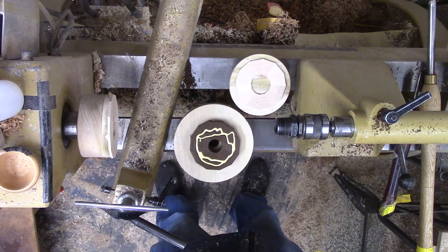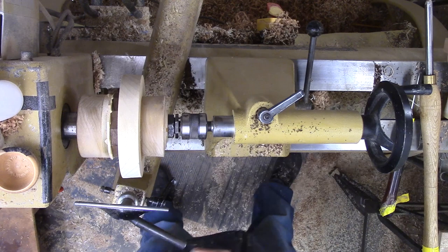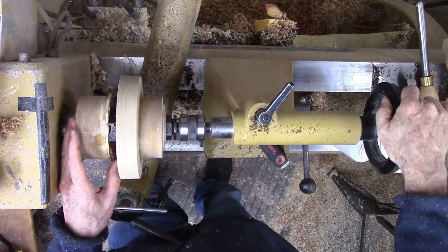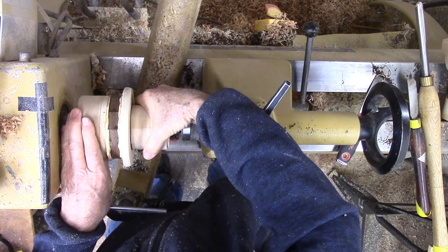The dark ash can now be glued to the maple. It is already centered on a faceplate. All I need to do is apply glue and press them together. After 5-10 minutes, depending on shop temperature, I can take it off the lathe and do something else. Right now my shop is cold, so I take it inside to be warm enough to let the glue cure. Please note that the dark ash is much thicker than I want for this layer. With the glue dry and a little denatured alcohol, I can release the dark ash from the faceplate. I have prepared the opposite maple and it is ready. Now to glue the second maple to the dark ash. Please note that the dark ash is still much thicker than my target but now is captured between two maple rings.